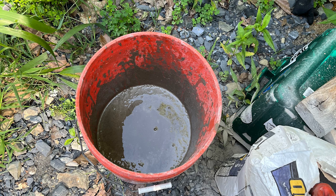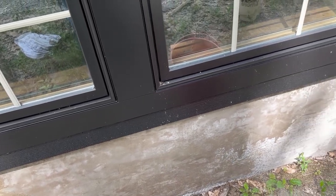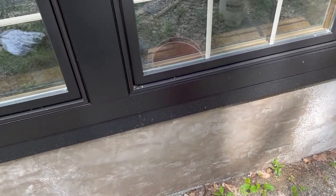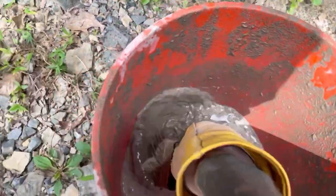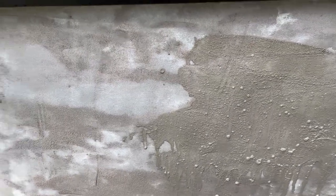Mike Haddock from Northeast Pennsylvania has a YouTube channel and he is the guy to check out if you're trying to fix your driveway or do anything with stone or cement. He talked about making a Portland paint and it saved this wall. You wet it really well, mix up Portland cement with a lot of water, and just slop it on — I was happy with the results.